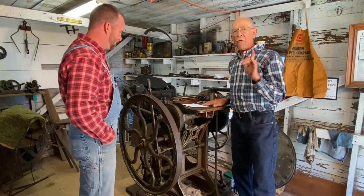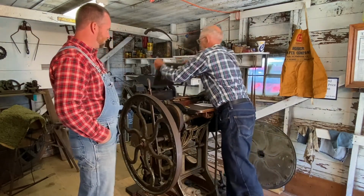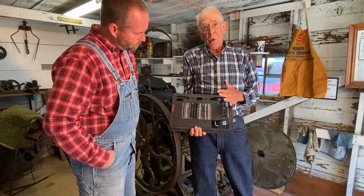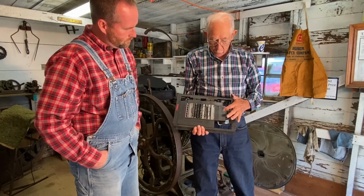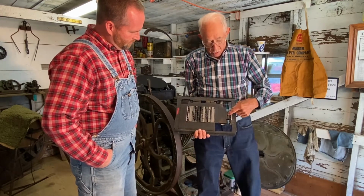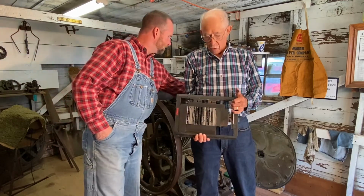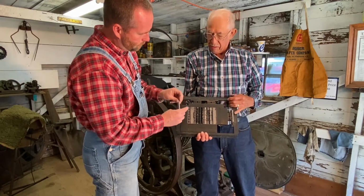Let me take the form off of the press so that you can see what we're dealing with. This form is composed so that it has all the lines and the letters. We're ready to print on this. It's locked up in a form. There's both wood and metal involved in this. It's got these wedges right here that are turned so that they expand and hold all this loose material tight so that it will not pop out of this form. This is a steel form around here. So these are all separate pieces like this thing. It is. And they all go in there together.